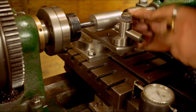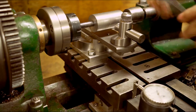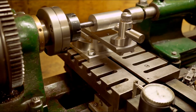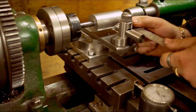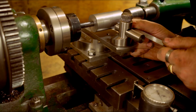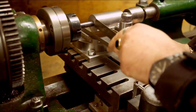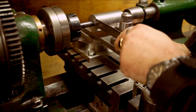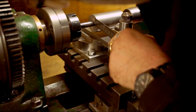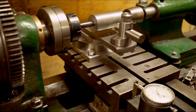So that is approximately, it doesn't bend enough. Get some gauge blocks or something, or a little angled adjustable parallel or drill bit or anything, but I estimate about 9mm from the tip to the part. So I just measure at the side, and 9mm is easily going to clear. It's about 14. So anyway, that's the distance.